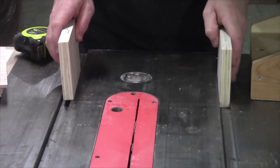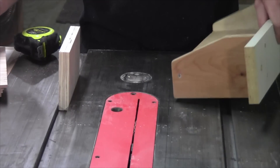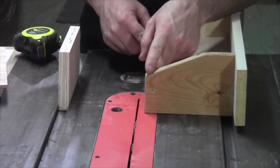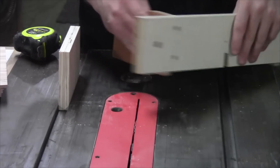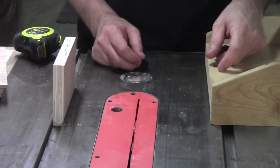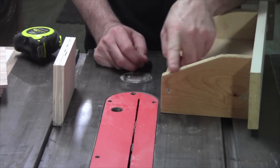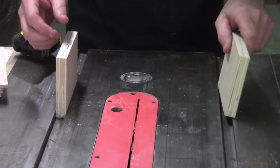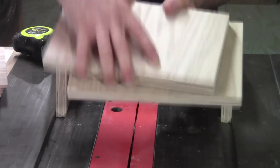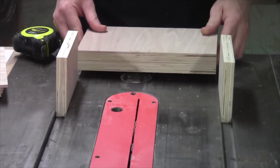Now's the time — on your two runner pieces that ride in your miter slot — if you want, you can cut a little down angle, similar to what I did on my existing jig. From the back side of the fence I went two inches and then cut a small graded angle down to give a nice comfortable hand area. You can do that if you like, or just leave it square. I'm not going to cut an angle on this particular one. If you want to add that angle, do it before the next step.